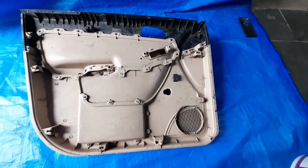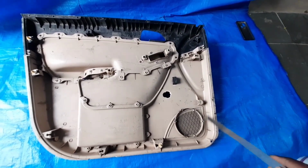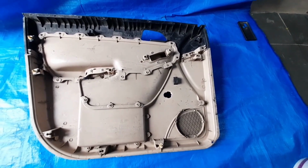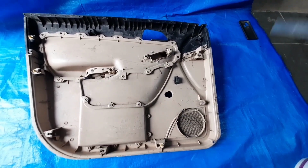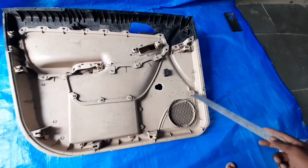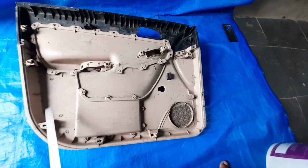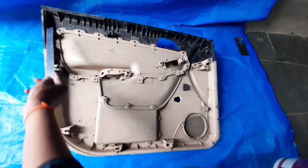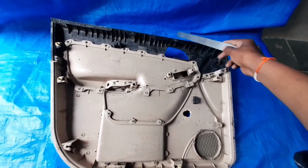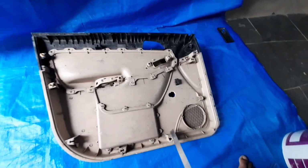This complete door is fitted on the BIW door, because this one is the trim inner door, plastic made. So this one we have to fix with the metal, sheet metal BIW door. So that are fitted with this doghouse, whatever is the peripheral doghouse. So that are the final fixation, because this is sub assembly done previously, and this complete assembly is fixed with this fitment, whatever given with the help of this doghouse return pin on the BIW.